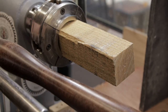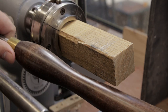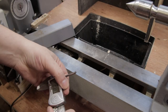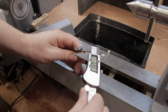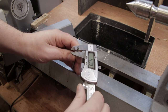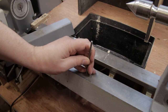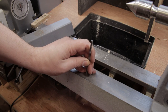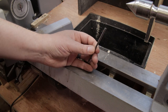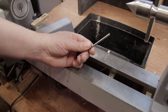Now it doesn't matter what size the tool handle is — it can either be a small one like this or a huge one like this. The order of process is exactly the same. The first thing I need to do is drill a hole in the end to accept this. I don't know how thick this is — four, three, five. Well, that's a nice awkward size. I reckon I'll go with four; I don't have a four and a half millimetre drill bit, so I'm going to go with a four, and there should be enough give in the wood to be able to put that in hopefully.